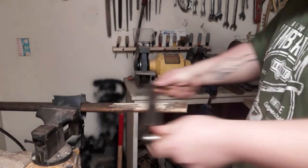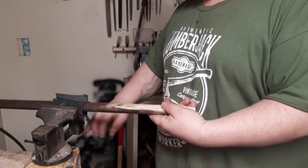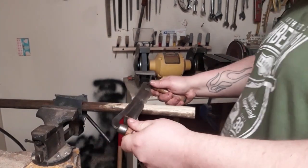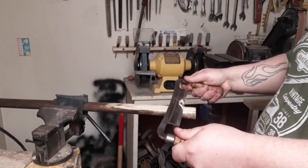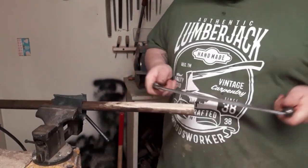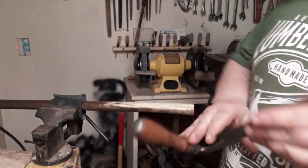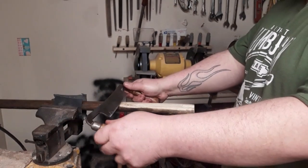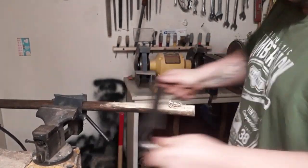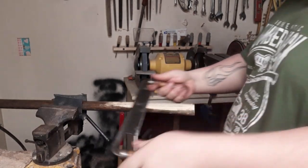I like the 8-inch or 10-inch because I can hold one edge and pivot the other side and get a lot of control that way. When you're hanging an axe or carving, this is really what you're going to be doing — little pieces — because once you get back here and start pulling it's going to chatter. We've got a nice grain on this handle pulling really nice. Let me flip it over and show you why you've got to be careful — this side here wants to dig right in. That's way too deep; once you get something like that you're going to keep going deeper, so you've got to cut it off or try the grain the other way.